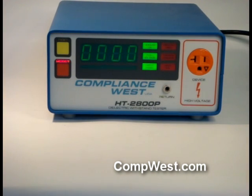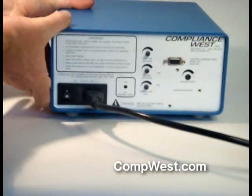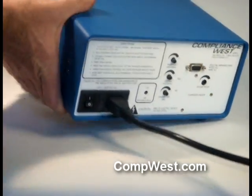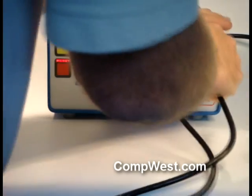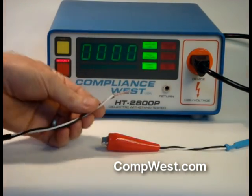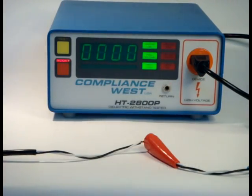Adapter J2 is used for two-wire connections. If adapter J2 is used, be sure to set the ground check switch on the rear panel of the HiPot tester to the off position. As a reminder, the top row of LEDs will light when the ground check is switched off. The two wires from your equipment are twisted together and connected to the red banana jack of J2, as we demonstrate here.